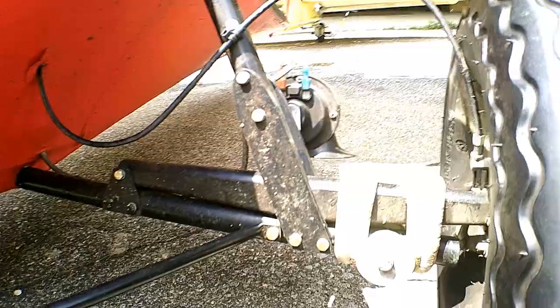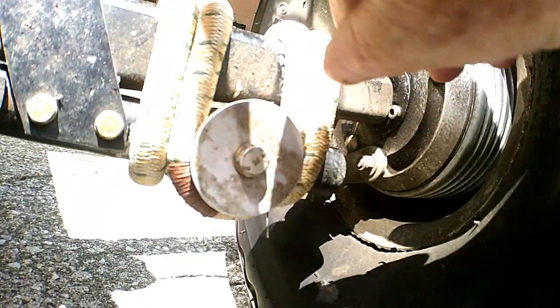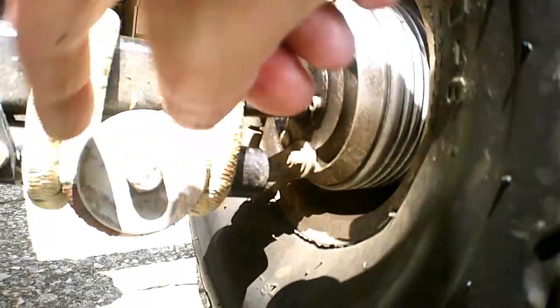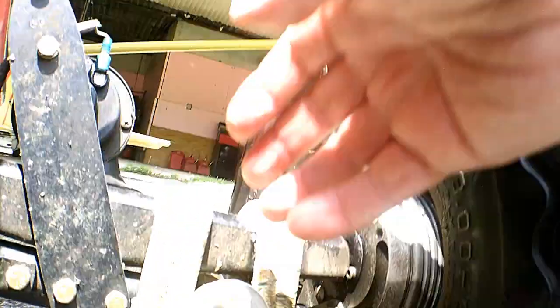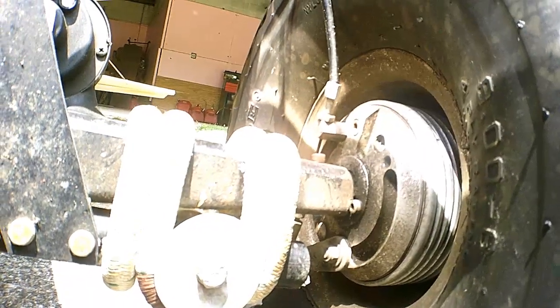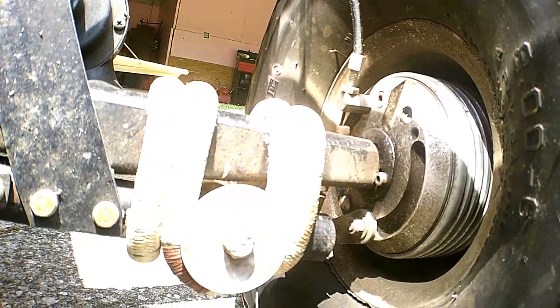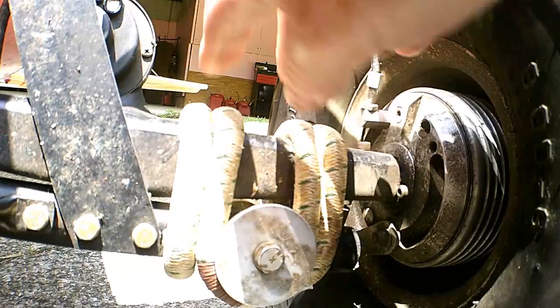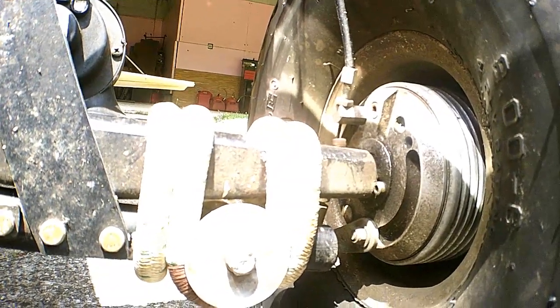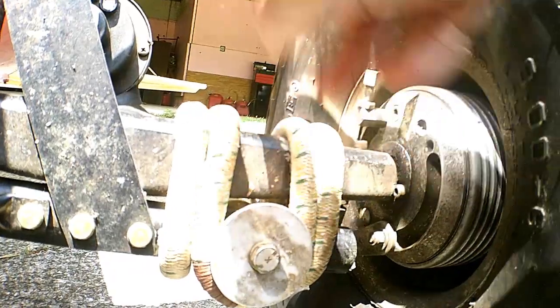And the other thing I did, as you can see, what they gave you for bungees with this thing, this is an ASAP manufactured kit. They had real small bungee cord in them. These are just like big rubber O-rings that fit a Taylorcraft landing gear, and I stretched them around with a tire iron, winding it around with a tire iron, and just pry it around and hook it on there. That's a lot stronger, and it definitely holds my weight and a passenger's weight. I don't want these landing gear to move, because if it works like the suspension of a car, there's no damping on this rubber. It's just like a pogo stick, and it's real hard to land because it's always going to want to bounce on you. So I want these rubber things on here, but I only want them to move if I hit too hard. Then they're supposed to move.